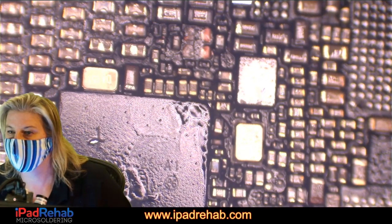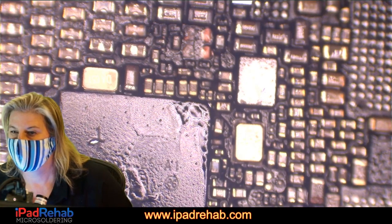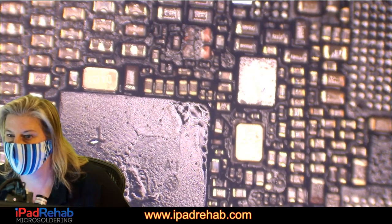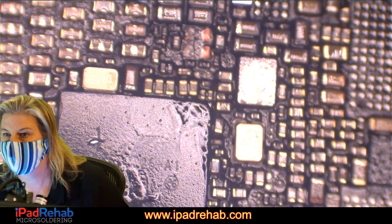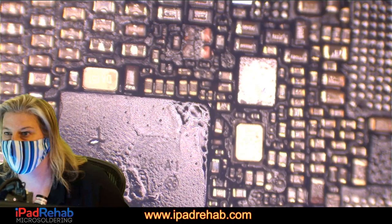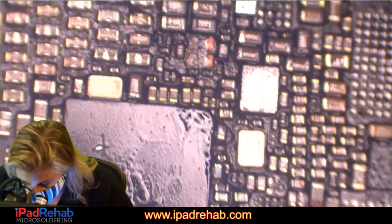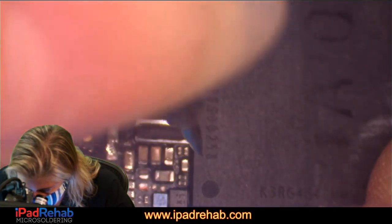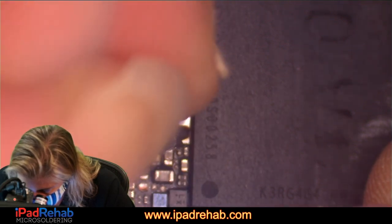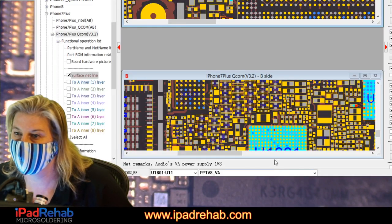What else? Let's kind of make it so we're cutting the cake this way, so we'll just keep working around. PP1V8VA. Could be. All right, where does that sucker go? Show yourself. All right, it goes to these two guys. I like that one. I like candidates like that, that kind of go where the water went up here at this top side. And they're pretty tiny. But it's not him. Go fish. He says go fish. All right, keep going.